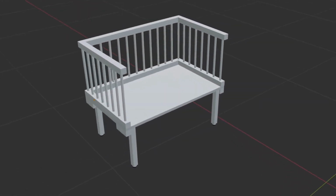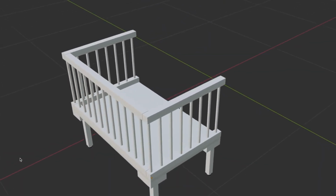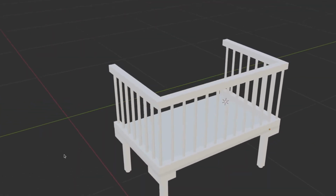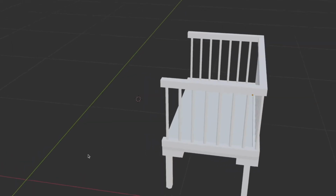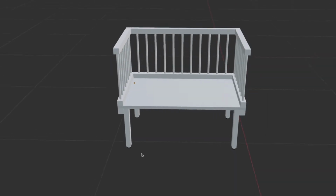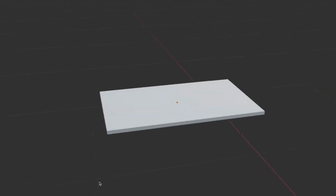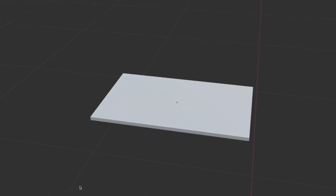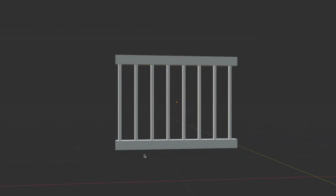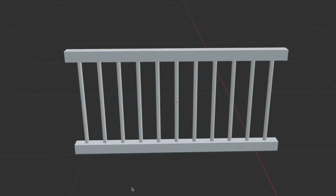The requirements I had was that the crib had to obviously be safe, sturdy, and easy to assemble and disassemble. I also wanted to maximize the use of wood, so most of the parts share the same piece of lumber. For instance, the top rail is the same as the legs and the L brackets that will hold legs in place. This is the part where the mattress will be held, which is slightly larger to accommodate for the rails, which consist of 2 each side with 8 bars, and then 1 at the back with 11 bars.